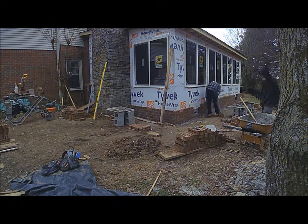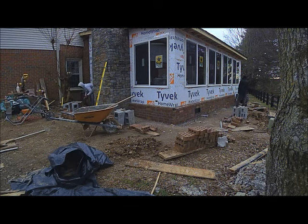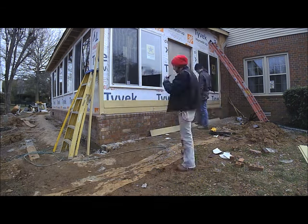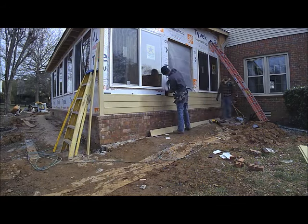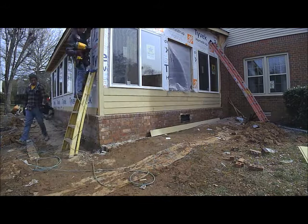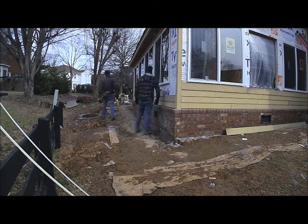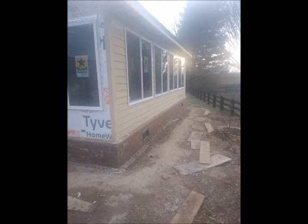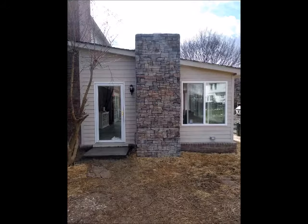My buddy Michael is doing the brick — he's a good brick layer with about 15 years of experience. Your top edge of brick needs to be sloped away from the building so water runs off. Now doing the lap siding — get your first piece perfectly level and the rest should follow. The middle window on this side had to be ordered in a slightly different size, but the same style — three five-foot windows across.